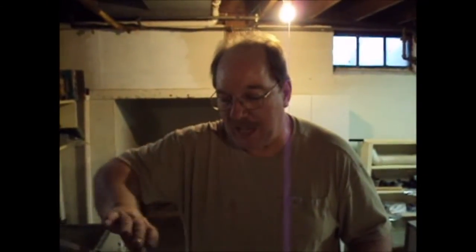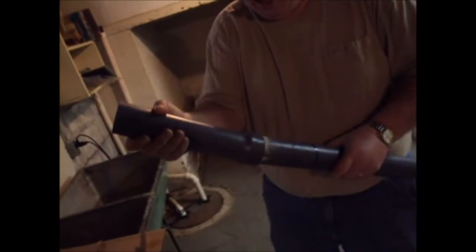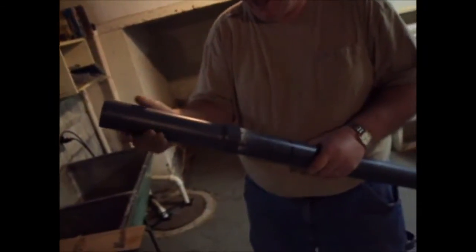One thing I noticed that you did — you didn't put it directly onto the end of the tube. You used the corner of the tube first. Right. Putting the corner of the tube allows me to kind of swage it and open that tubing up. It lets it slip over the end a little easier. We call you Patrick Swagey. That was my joke — you're welcome, YouTube.